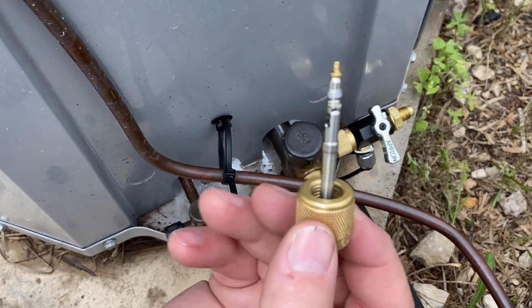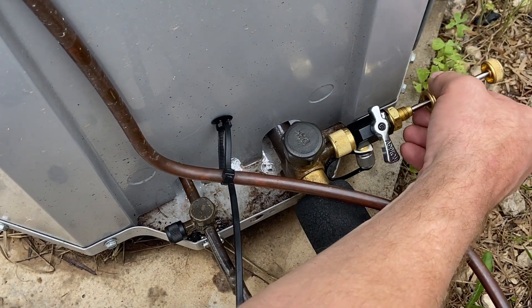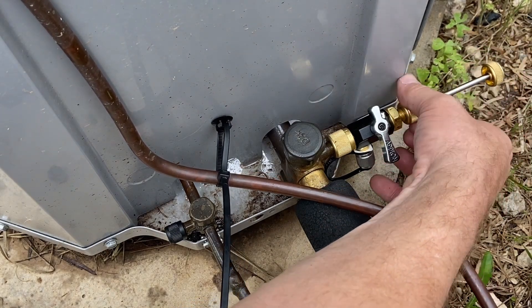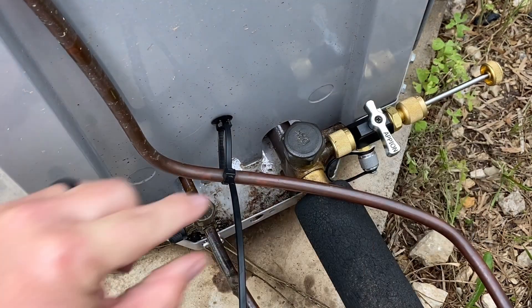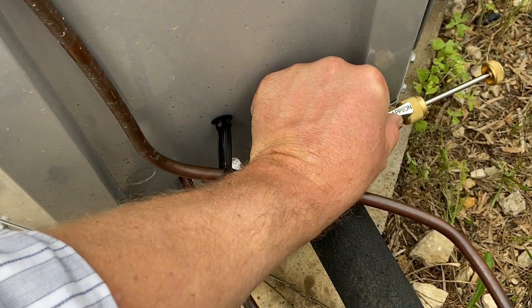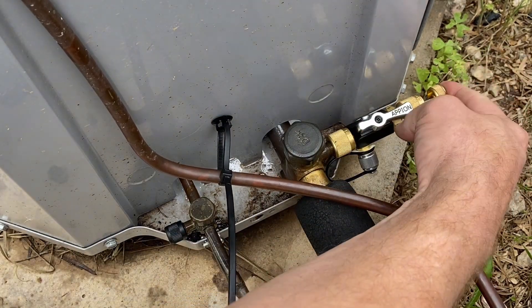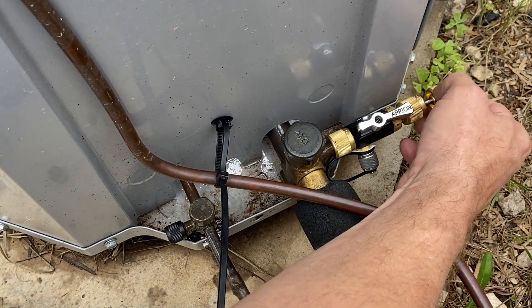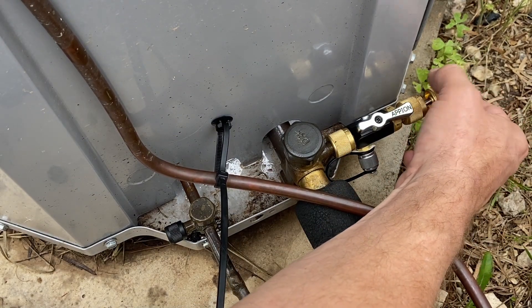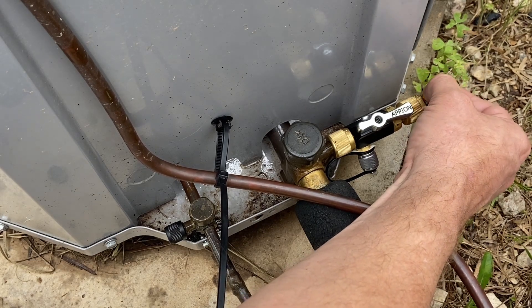If I put the new one in, I just place it in just like this one is. Notice I didn't touch this one — I don't want to contaminate it. We put it right on the very end. Now I'm going to open my valve core tool. I'm going to overcome the pressure with one finger and push this all the way past this valve back into this component here. And now as I start threading, I'm tightening this up. I don't want to over-tighten it, just snug.